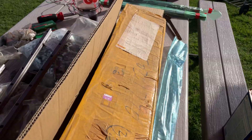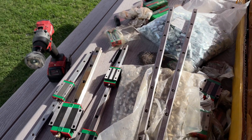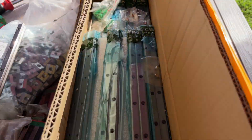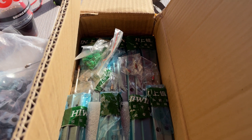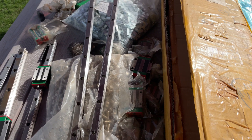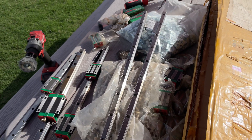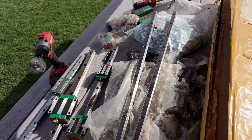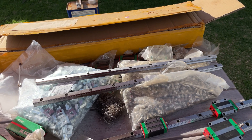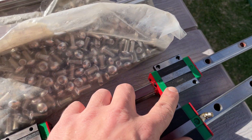I just wanted to show you what I had. I kind of want to sell it — I don't want to design a CNC machine around rails that are smaller than I'd like. These are like 540 mm and I've got 720 mm on other rails. But I don't want to design it and then find I want something bigger — the plate steel deflects the beam and I've got to go back to the drawing board. Better to go 30 series, scale up, and design everything around that. If it's overkill, I don't have to worry; if it's underkill, I'll have deflection and end mill issues I don't want to deal with. Also consider the screws — that's an M4, that's an M5.